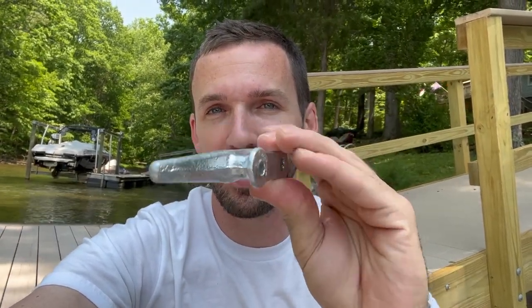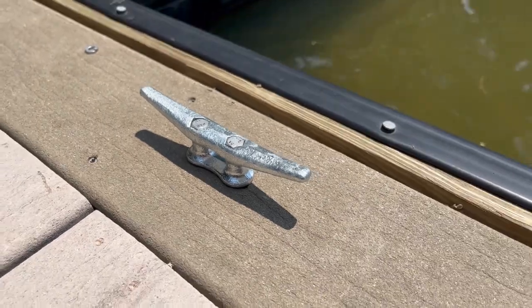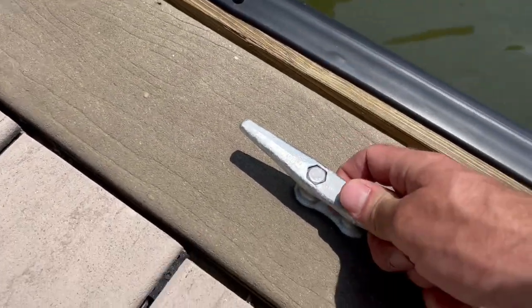What's up everyone? Today I'm going to show you really quickly how to install these little boat cleats like this. This is a six-incher but you can use eight-inch. Size doesn't really matter in this case. What matters is this thick L bracket here made of steel, and this is what's going to tie into your boat docking frame — that's where your structural support comes in. So let's install these today. You can get all these products off Amazon; I'll have the links down below.